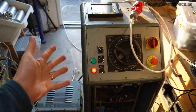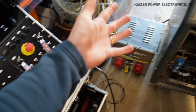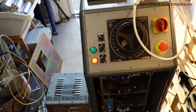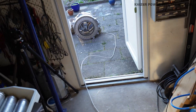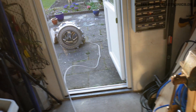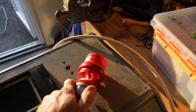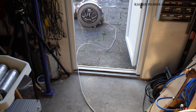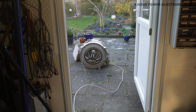For some reason my large Variac just keeps blowing my fuses. I have no idea why — I have the soft start box in, I thought it was the inrush current, but I'm not too sure why it's not working. So now the washer motor is there and I'm thinking let's just plug it straight into 3×400V AC, despite it being twice the voltage. It's probably going to explode. Here goes.